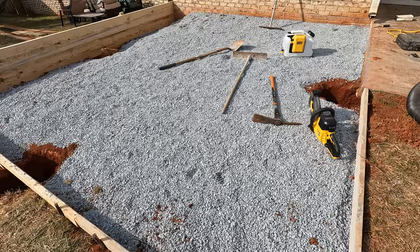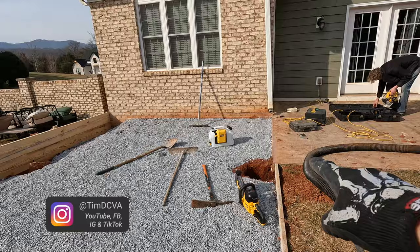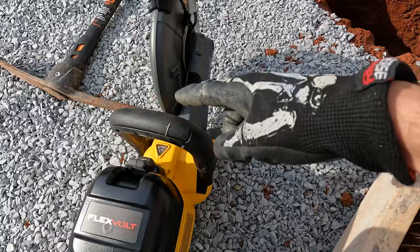The way this is set up, it has to be perfectly square because we're putting a roof or porch over it. This existing slab was out of square when it was originally poured, so we're going to take the new DeWalt concrete saw and portable water feed and cut that section off of the patio.